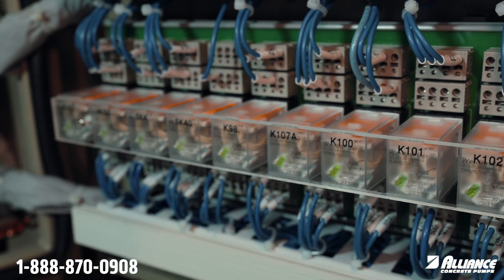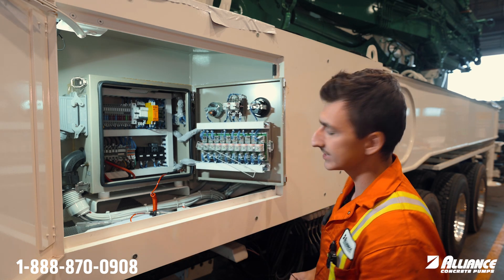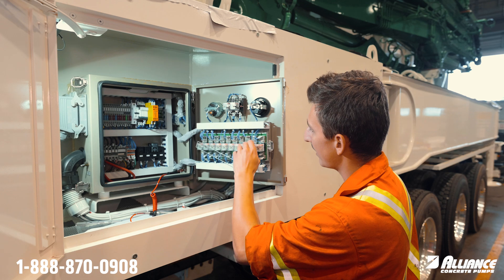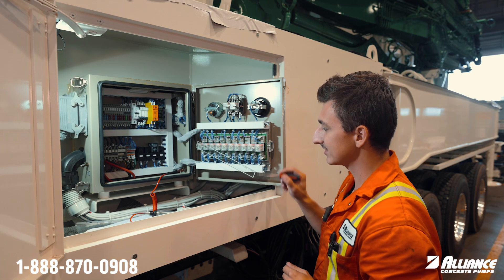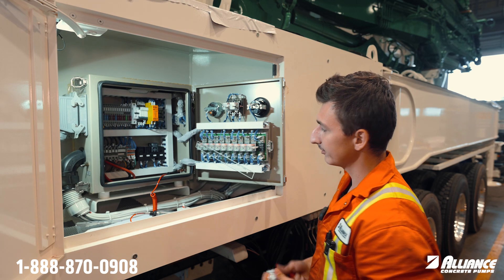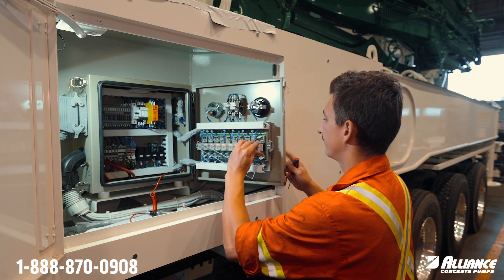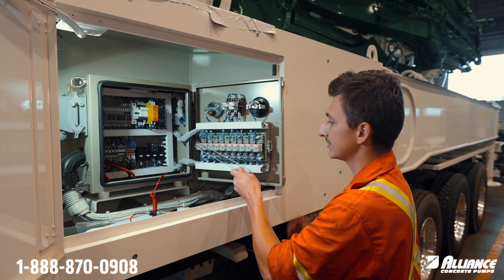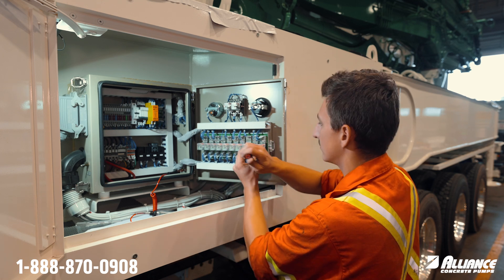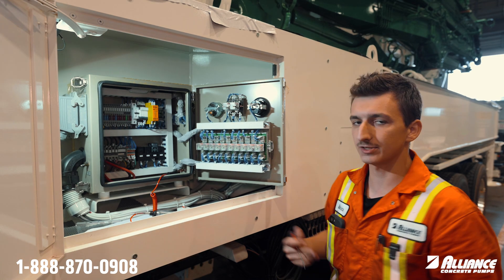Swapping the relay is fairly easy — this one's on the end so we're very lucky. Unscrew a very small Phillips head; I only like to do one side. Tilt this out of the way because this little screw likes to get lost, then put it back in just three threads so it doesn't fall out — I'm sure you've seen the screw fall and hang down for the life of the pump. Pull that out, pull the relay out, grab a good one — brand new, one you know is good. Swap the relay, pop the new one in, reverse the process, throw that screw back in, line it all up, do a little by hand and send it home.